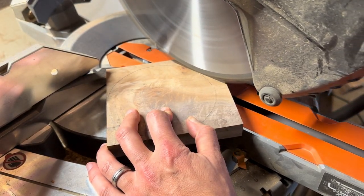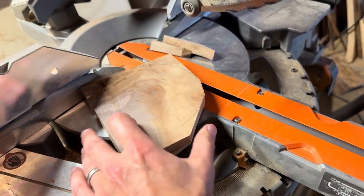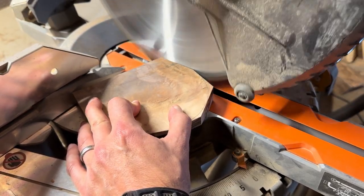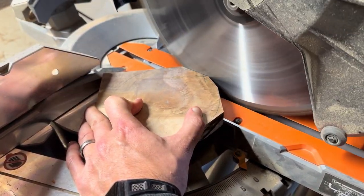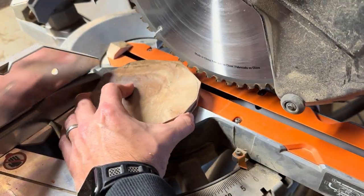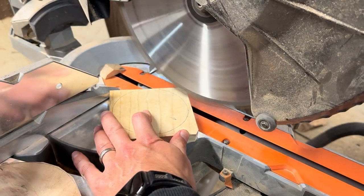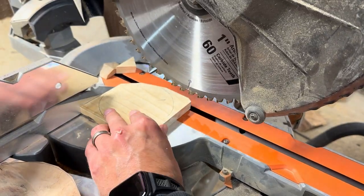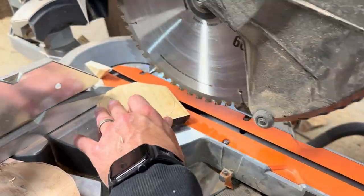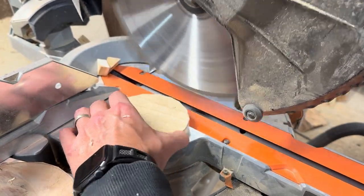So what you're about to see me do here is how I'm cutting down my circle. I don't have a circle jig or anything like that. I looked at using my router but I didn't like any of the methods I was thinking about. And while this worked for me, I don't recommend this as a super safe way to do this. In the sped-up version you could kind of feel it at times trying to pull. Being able to take down just a little bit at a time the way this saw works was helpful, but I don't think this is the safest application. Maybe try a different kind of jig or something else, because I could see this going wrong and trying to pull you into the saw blade if you don't have a really good grip on it.